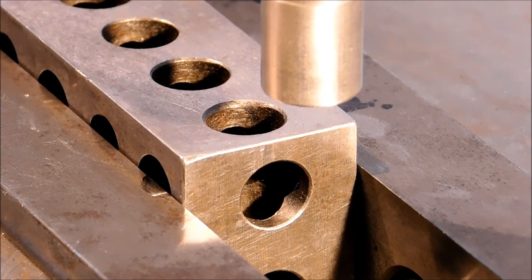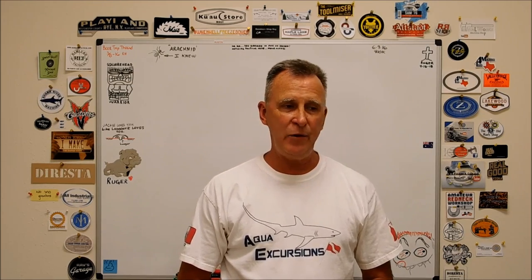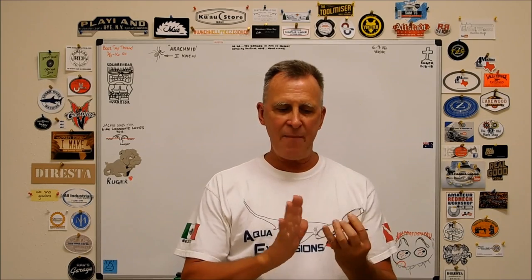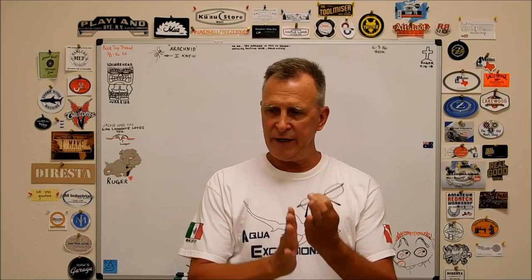All right, well, I can guarantee that if you successfully pull that off, that that's going to be in your box for a really long time. And if you ever do have any problem with that thing sticking, pull it apart and lap the two faces that go together. Just put it on a piece of 800 or 1600 emery cloth and just wipe it out until it's nice and smooth.